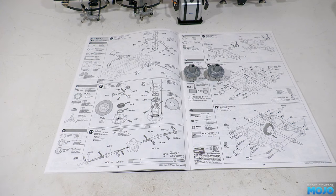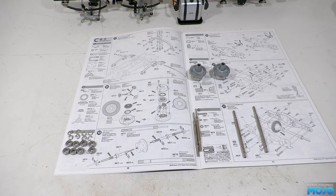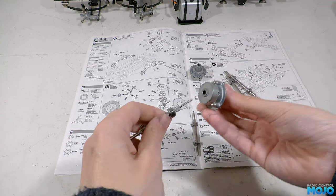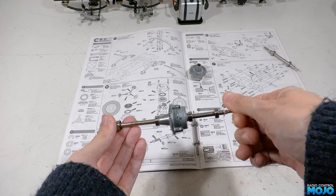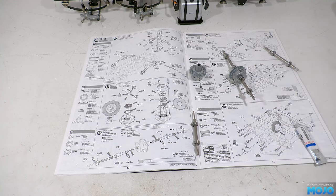Also, another quick note: since the truck might find itself on some loose terrain getting filled up by the diggers, I've built one of the diffs with Tamiya anti-wear grease, which is extremely thick and sticky. It'll go in the frontmost axle so you have a little bit of positive traction — it's not going to be locked, but it should be stiff enough to get out of trouble. Step 19, axle shafts. This is just a case of adding a couple of bearings to each shaft and clipping on the E-clip. Then we grease up the ends and pop them into the diffs, making sure to use the same type of grease that's on the inside. If the shafts won't slide in easily, the internals might be misaligned and a bit tight, so we just need to loosen the screws a bit, jiggle the shafts and re-tighten. The important thing is not to force them in. The diff built with the ceramic grease should be lovely and free to turn; if you go with the anti-wear, you might find it a bit stiff to turn by hand, but don't worry too much.